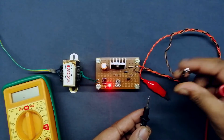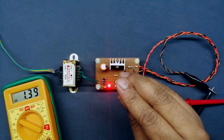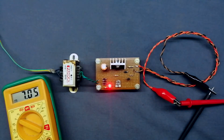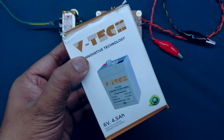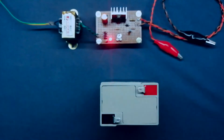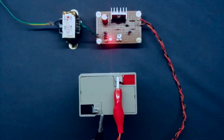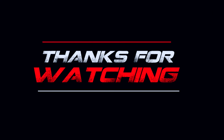The charger output is connected on the multimeter. Adjust the preset to set the output voltage to 7.5 volts. Setup is now completed. Now set up the 6 volt battery — I am using a new 6 volt battery. Connect the charger controller: red alligator clip connected on battery positive lead, black alligator clip connected on battery negative lead. Now the setup is completed.